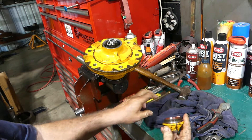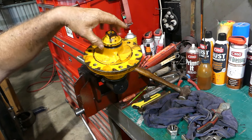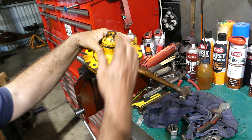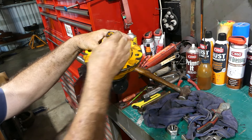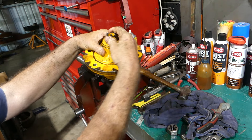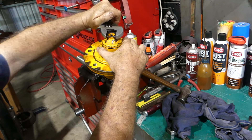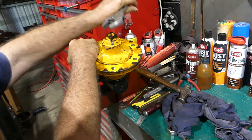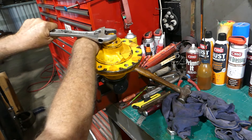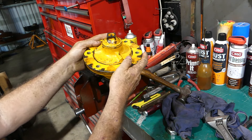That's not too bad - nice and clean. There's a little gasket on there and I'm going to leave that little gasket on. From time to time give this fella a pump - probably whenever you change your engine oil would be enough, just a couple of pumps. Over time it'll probably fill up. Now that's as tight as I'm going to go with that for the moment - once I get the wheel on and I can hold it easier, we'll go that way.